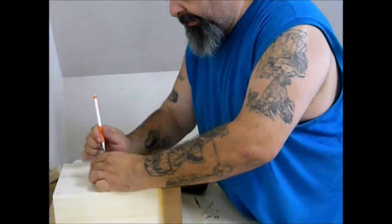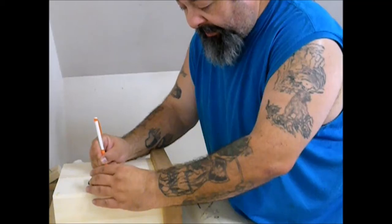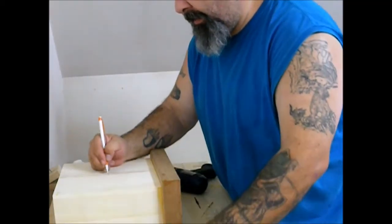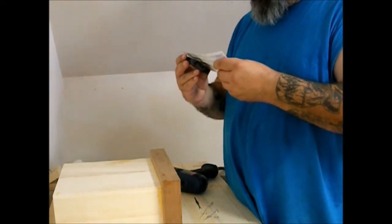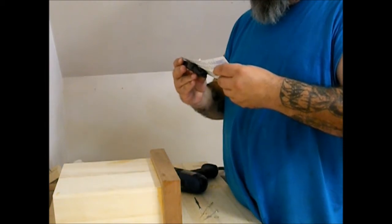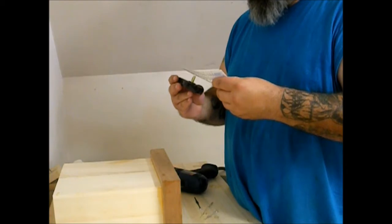I can then go right about here. And that'll be good. Now, in order to make sure that the hole is right, I've got this cool little gauge, and by taking the post and putting it through the various holes until I find one that fits just right, it looks like 5/16 is our winner. So, I'll drill that out, and we'll put this in.